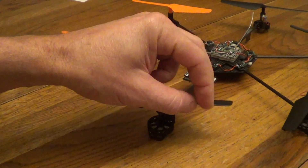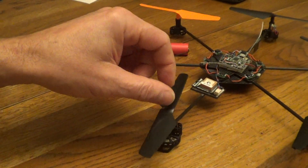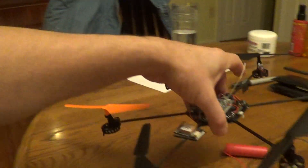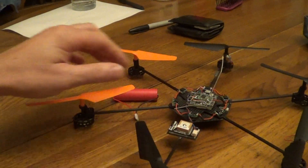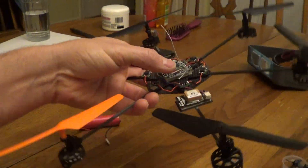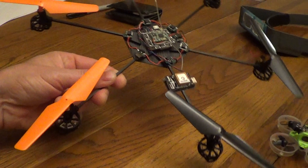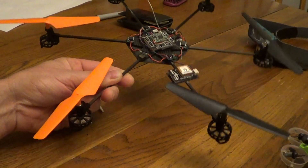It probably has to do with not encountering the turbulence from the previous blade rotation — that's why some people even suggest a single-blade prop, to get cleaner air. When it's moving forward it'll have cleaner incoming air too, so efficiency should go up. That'll be the cool thing about seeing the actual amp draw — I'll be able to compare current in hover versus forward flight. This is just a long-range, long-endurance quad.